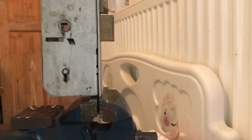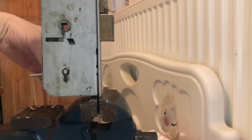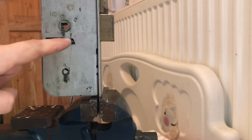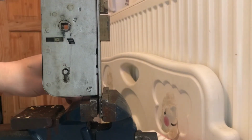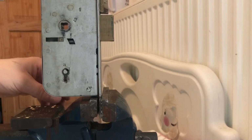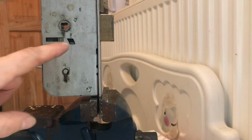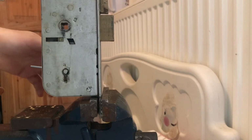And it is possible to drill these locks in a specific place. So this is the key, it says there. If you watch this little stump raise up, that's what will allow the bolt to pass. Okay, can you see that? Ding. Okay, it's a bit temperamental, this one. So if you really had to, you can drill this little stump thing here. Obviously I wouldn't advise it.